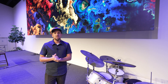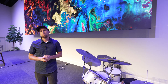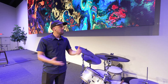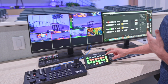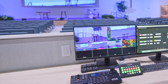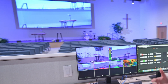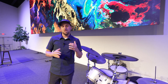When we do the install, our technician makes sure all the panels are configured properly in the processor. All you need to do is feed it that HD or 4K signal and it's going to look great on your screen. We also have an SDI video feed going into the processor from our Constellation video switcher, which can throw a camera feed up for an iMag — or image magnification — effect. So if they want to zoom into something on stage and blow it up for the congregation to see better, we can send video content in real time to the screen, and it looks incredible.